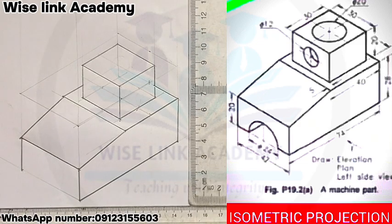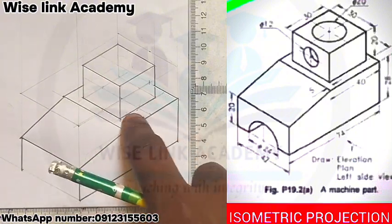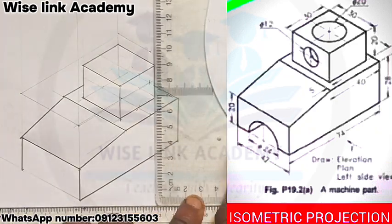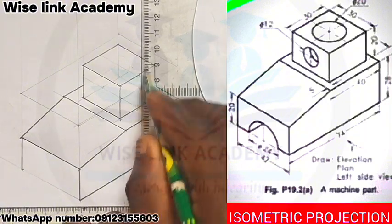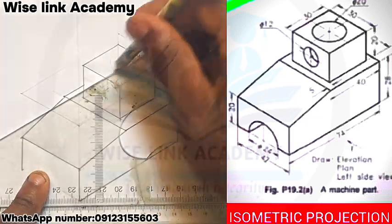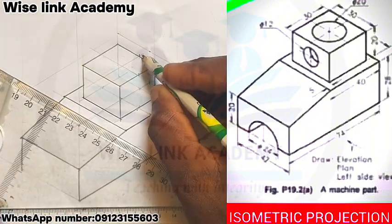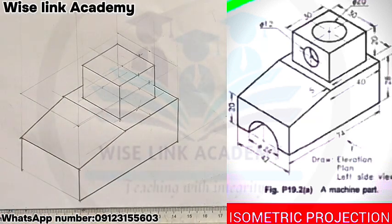Since we have drawn a square down here, as you can see, we have gotten the center to be this one side. I'll take this side here, I'll take the side up, this one here, this side here, take it up, this one here too, take it up here. So it means that I'll take this one down this way, the faint line, and take the other one here, down this way. Where this and this meet is at this point. Now that point, I'll construct out the circle.